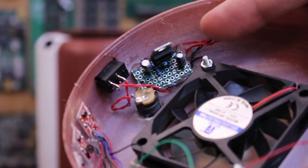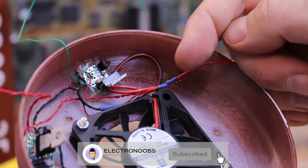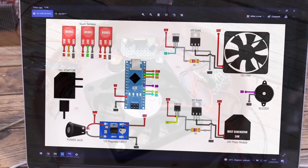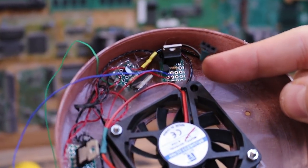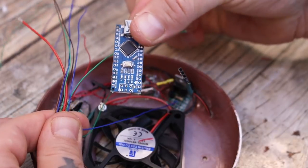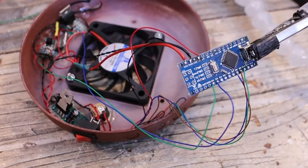We should also add the fan and using some screws we fix it in place. Also make sure that it pulls the air in and not blow it out. To control the power for the fan and the mist generator, I've made a small PCB with a MOSFET and a BJT transistor as a gate driver. This would have a connection to ground, 12V for the BJT transistor and signal. Check the schematic for more. So I connect this to the fan and glue it in place inside of the 3D printed case. Then I make another one for the mist generator but this would work at 24V. I connect it to some female pins and glue it inside of the case as well. Using those female pins we can connect later the upper part that has the mist generator. Now it's time to connect all these wires from the buttons and MOSFETs to the Arduino. I take each one and connect them to the digital pins and also supply 12V to the Arduino from the regulator. Now everything is connected.